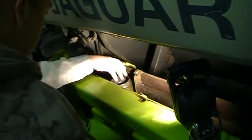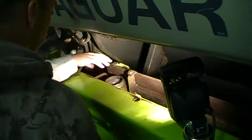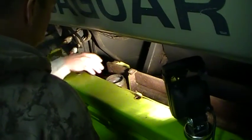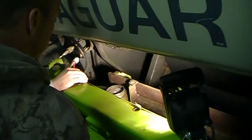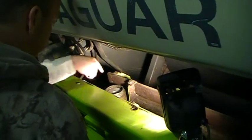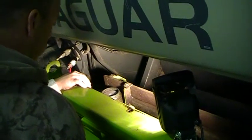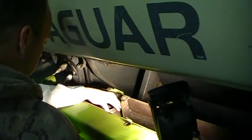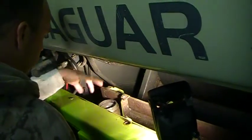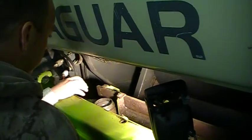You're going to back out first because your pin's going to be in the out position. This is going to be unlocked. You're going to take your lock tab off. Okay. And you're going to put your tool on there and you're going to back it out. You're going to have this pin trying to push in there, and as soon as this whole housing backs out, the pin's going to lock in. Okay. When the pin locks in, then this whole brass piece is held to where it turned, so you can break the nut loose. Okay. You break the nut loose, then you can take it off and pull it all back out.